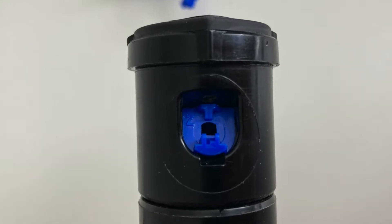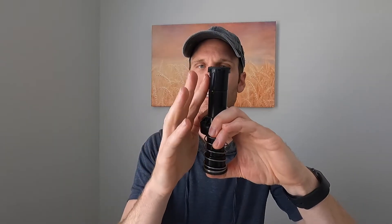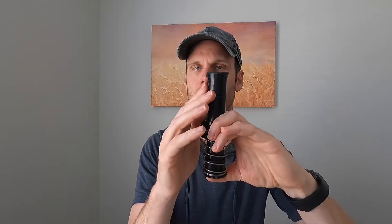When installing this nozzle, make sure you have it facing the right side up — this is the top and that's the bottom — and we want it to sit in there just like that. Take notice that it actually goes inward as you're installing it. With it facing the right side up, slide it into there and press it in all the way so it's not sticking out from the mouth of the sprinkler head. Make sure it doesn't rotate, then press it in all the way.